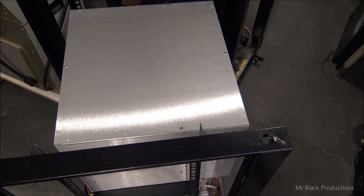Now the other option is I hang the blower off the front side of the box. Once again, it has a chance of interfering with the high voltage, and then it puts the noisiest part of the box the closest to the front, which is bad. Hence the reason we did all the sound deadening material in the previous segment. But there's yet another solution.